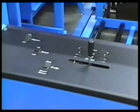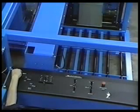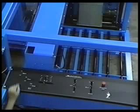The left hand joystick controls slide movement, magnet on/off, magnet rotation, and magnet reach retract. The top rocker switch turns the magnet on and off. While the magnet is on, the forward reverse travel is slowed to low speed.